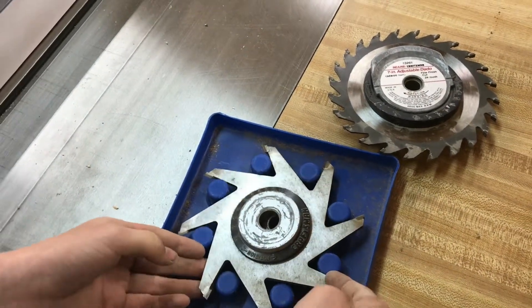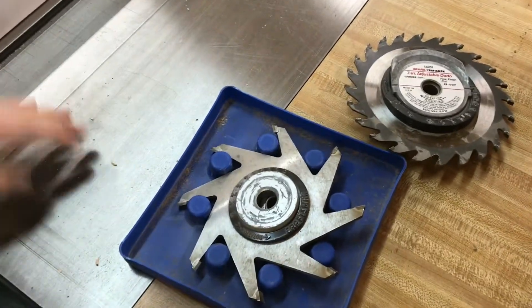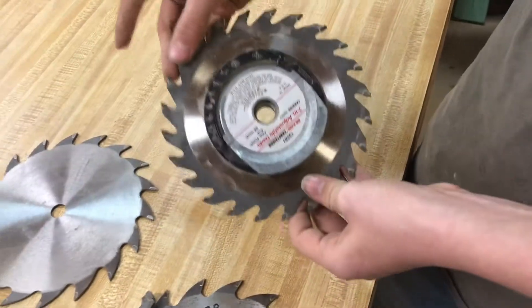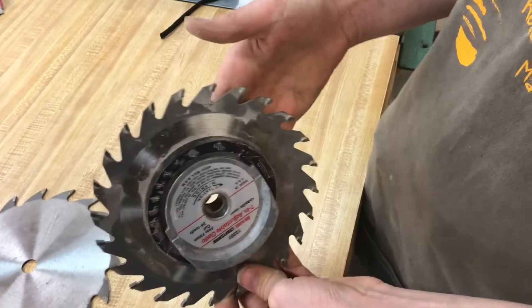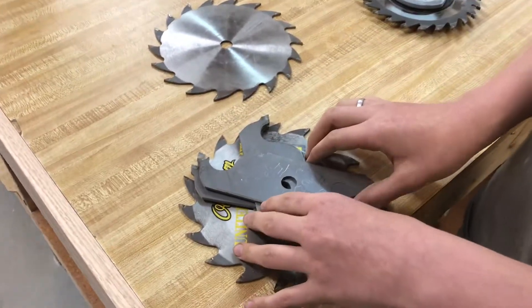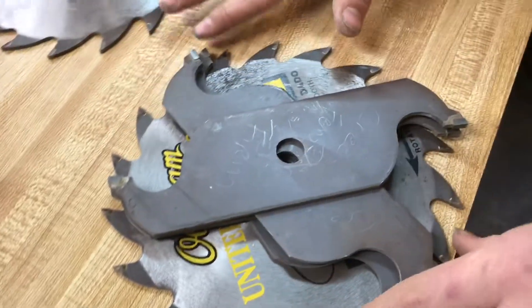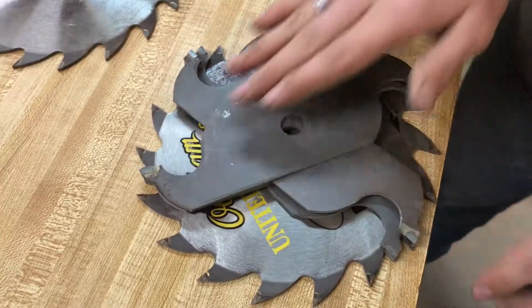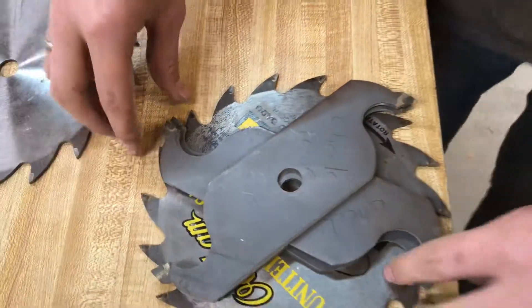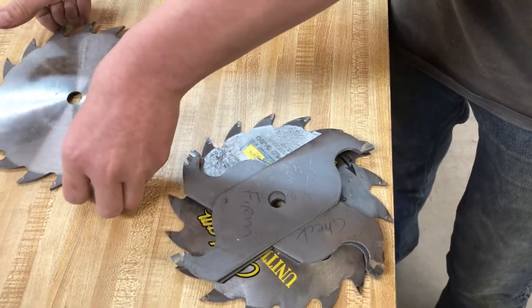Really the safest way is to use the stacking dado blades, and that's what we've always used in the shop. This is the safer solution to the wobble wheel — I mean wobbling a wheel that's super sharp and dangerous sounds like a pretty bad idea, because it is. This is the stackable one where you stack the blades: one on the bottom, one halfway across, then one matching up with this one and the top one matching up with this one. So you just line those up with the center and put on the last blade.